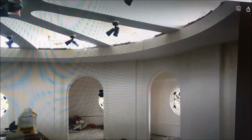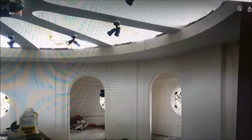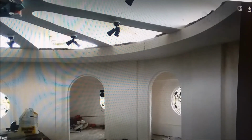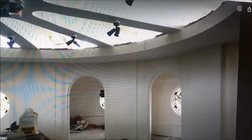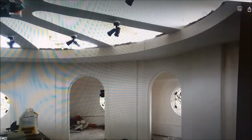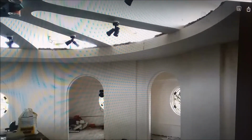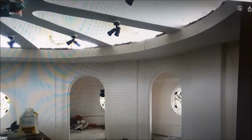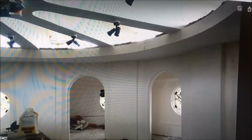This is going to have a molded edge up here of concrete, and plus there's a security grill that goes in here, and some of this opening out here gets closed off. So we're going to cut back on the water, and also where you see this down here, this is open to the roof. There's a curved end that goes on these air openings, and that's to put the concrete into the form, into the mold. We made the forms, we just never poured them. The mixer's left on the roof so we can pour them, and then we're taking the stairs down that we take the mixer up and down with.